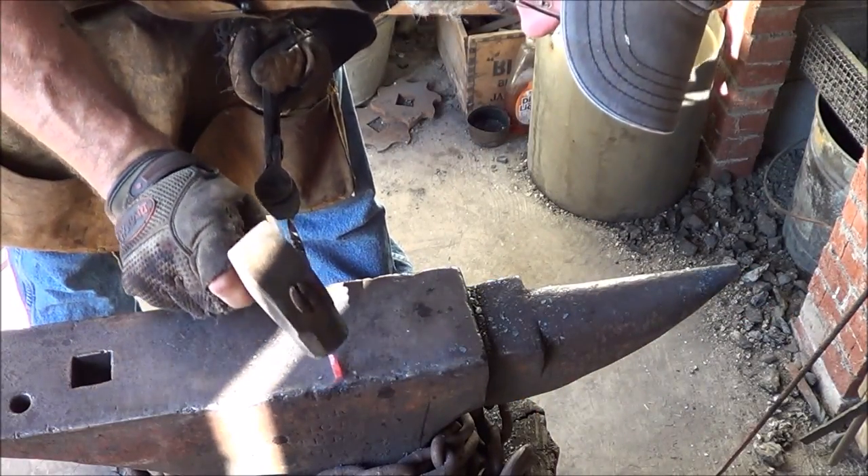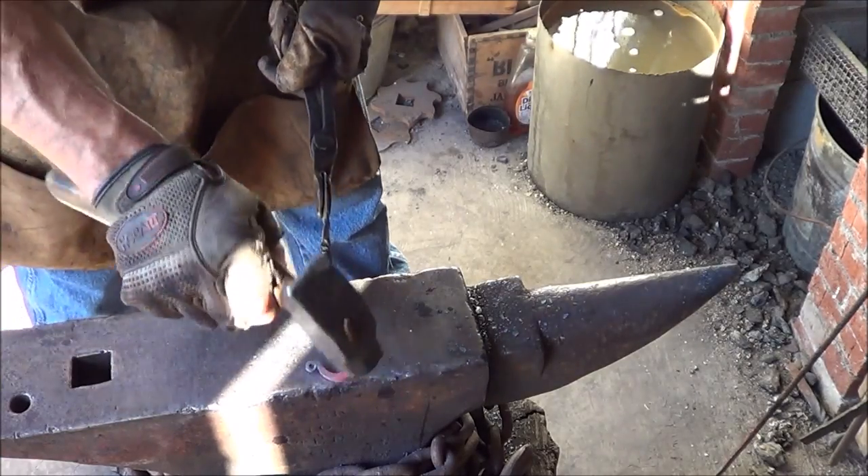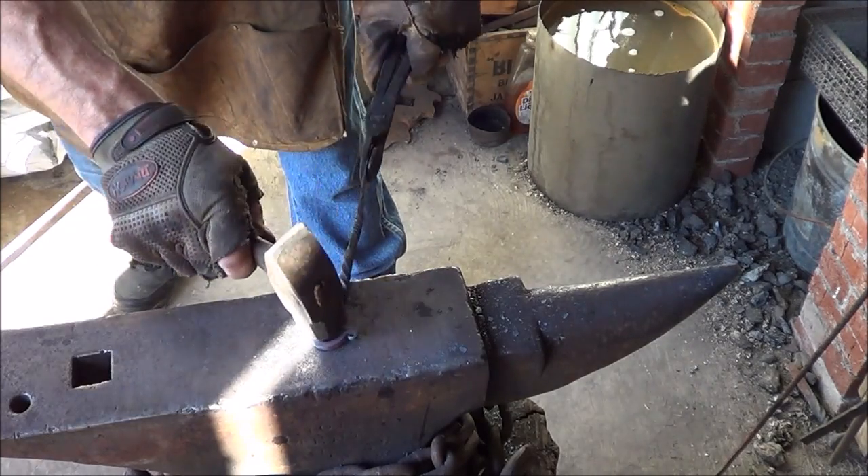There's the hook — we'll put the twirl on the end, or the scroll, or whatever you want to call it. Just a little run around the end, and like I mentioned in the other video, I like to go tight and then one more turn. Very often I'm taking another heat, but I like that little extra roll in there even though it kind of messes up the hook in the process. I do the extra work for it. Get one more heat on it, shape it up, go back to the anvil and clean this up, get that curvature where I want it.